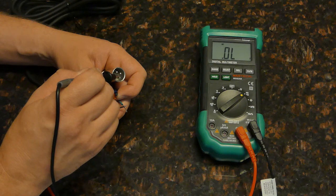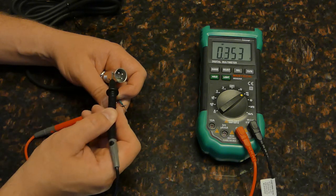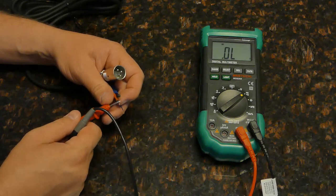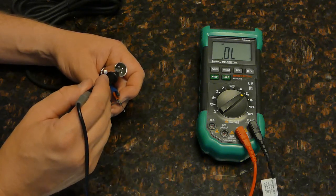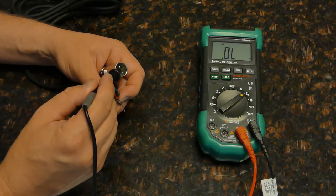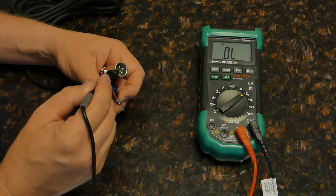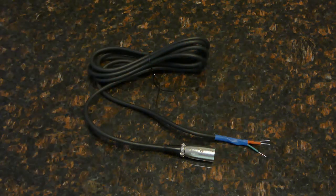From here, you're going to want to make sure your cable is working perfectly. Pull out your multimeter and run a continuity test to make sure that each pin on the male side is running to only one of the exposed cables on the other side. Also note that on this XLR connector, the shell is connected to the ground pin. If you don't like that, you can either sever the ground tie or run it as its own separate line in order to test a floating ground or non-floating ground.